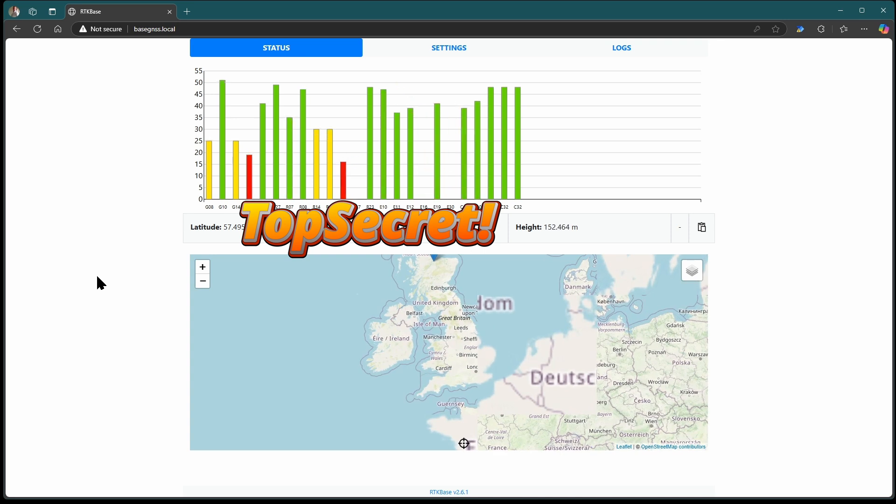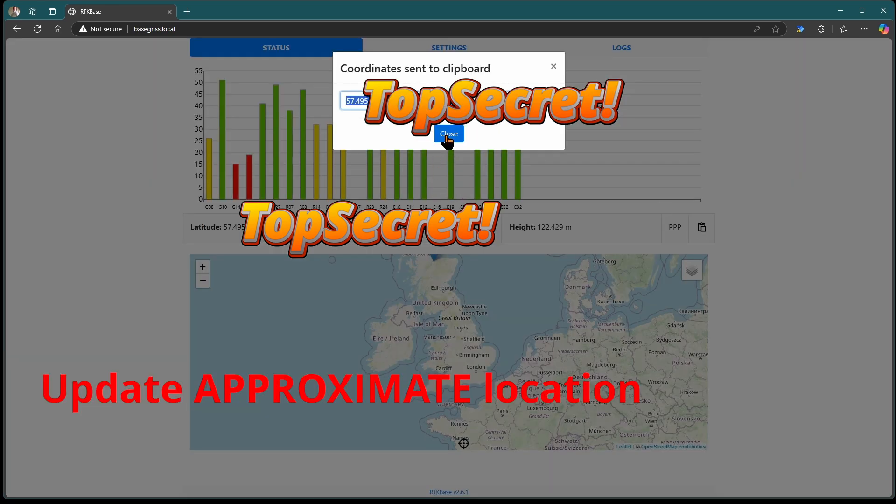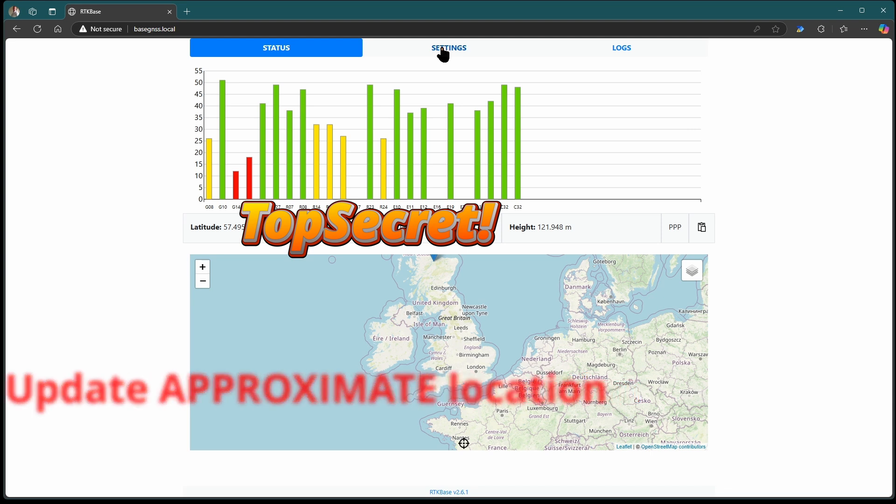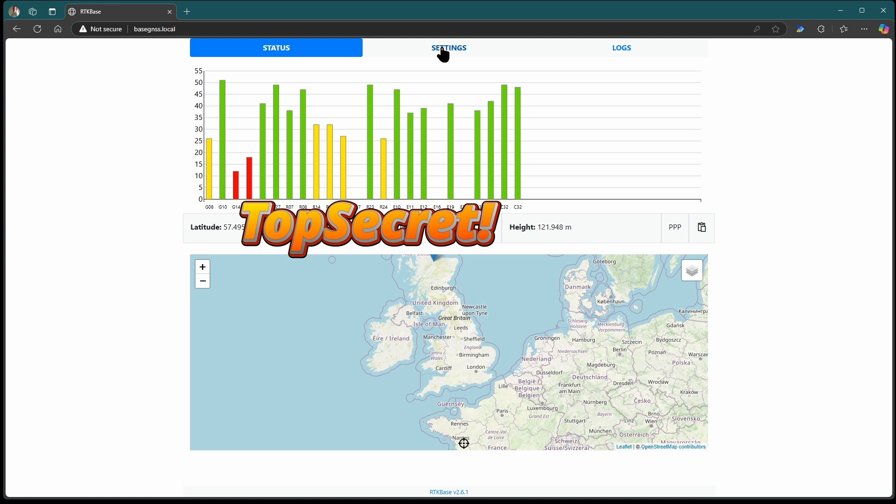Here I used a spare antenna just outside the window, and we can see from the bars that we aren't seeing many satellites and the signal is very poor — this is just for demonstration purposes. Eventually it is able to get a poor approximate location. The black target is the current fixed location, and the blue icon is the current GPS position as read from the satellites. As you can see, it moves about the target a lot, even when they're supposedly close together. This is the distortion that RTK corrects for.